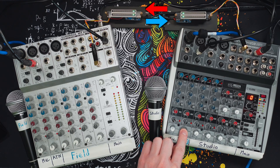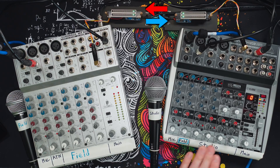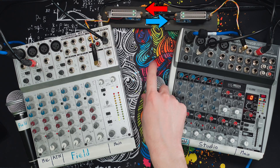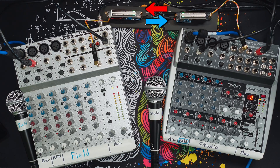So we actually want to apply another Mix Minus in the studio as well, so that the field does not receive themselves back. When we do that, we see that audio only shows up going from the field to the studio, and nothing comes back directly. The same thing works the other way — audio introduced into the studio only shows on the meters going from the studio to the field. That way, both sides can talk without hearing themselves back on a delay. Mix Minus is very useful in live broadcasting and live sound reinforcement where remote guests, reporters, or musicians need to hear the main mix but should not hear their own audio returned to them.